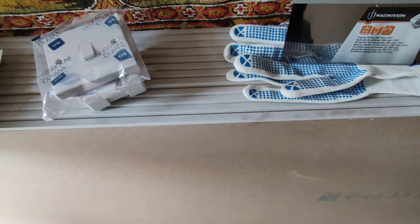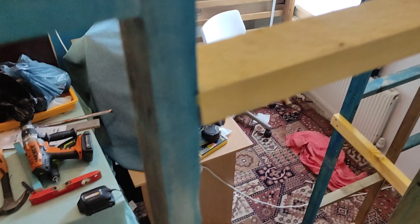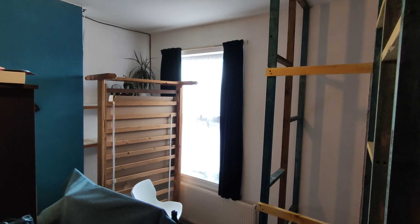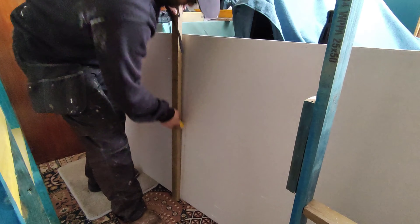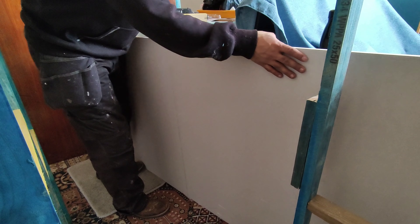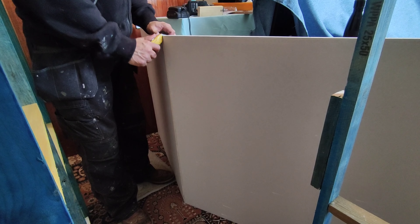There will still be enough room in this room for a normal box room - there's still room for a bed, wardrobe, and computer desk. I'm also going to get another door because I need an extra door. Plasterboards are fairly straightforward: use a Stanley blade, mark out where you want it, cut and then break - nice and easy clean cuts. Where possible the least amount of mishaps the better, because you'll have less things to fill up and fewer joints. You can get plasterboards in different sizes and it works out for you.